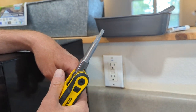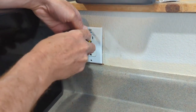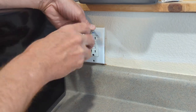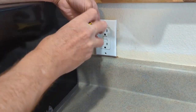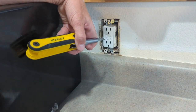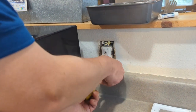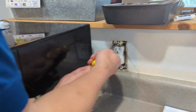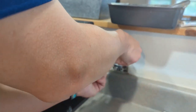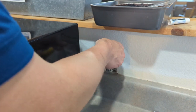You're going to want to use your flat head screwdriver to remove the face plate. There's one screw in there. Also, take that bracket part off as well. Do not do this with the power on — do not do this with the power on. You could get zapped. Test it and retest it — always test. And on that testing, test it on a good outlet to make sure that you know the meter works as well. Power off.